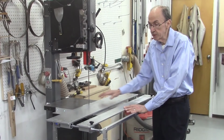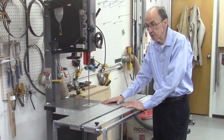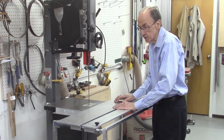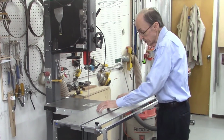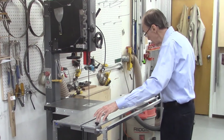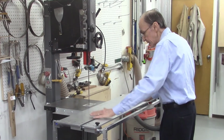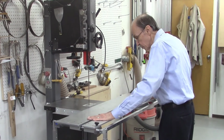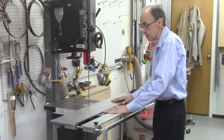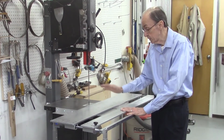So that completes this part of this video, the assembly of the frame for the system. In the next video, I'll go into the next steps, adding the linear rail, the Accu-Slice rail, the linear ball screw, the stepper motors, or actually the servo motors with the indexers to move the table. And those indexers will be placed one out here and one out here. So instead of on a previous system where you have a single indexer in the middle, you can have twisting at the ends. By mounting these 2 indexers on both ends, they'll both move accurately. So they'll move nice and straight, and there'll be no twisting of the table as it's moving. So that should be an improvement to give you better accuracy when cutting boards on this bandsaw using the Automated Accu-Slice System.